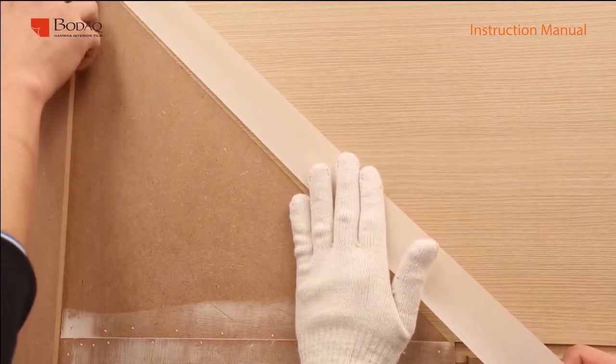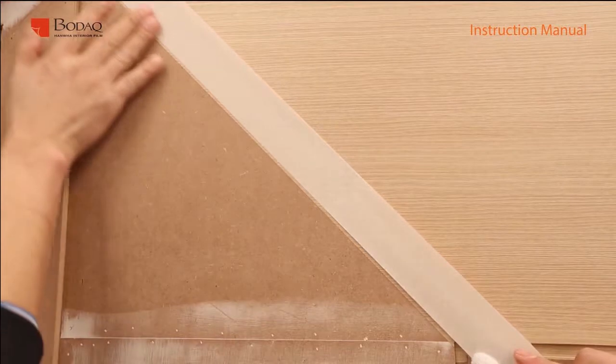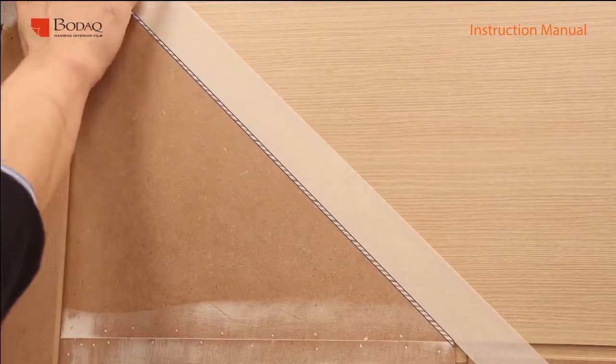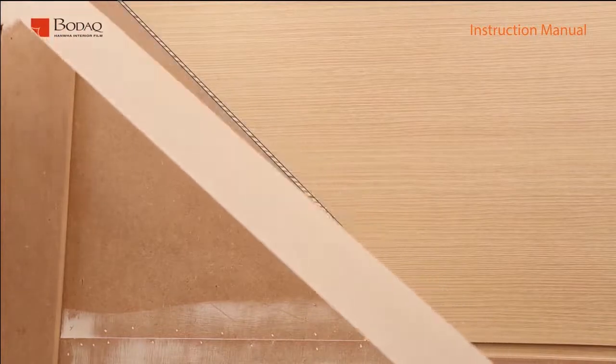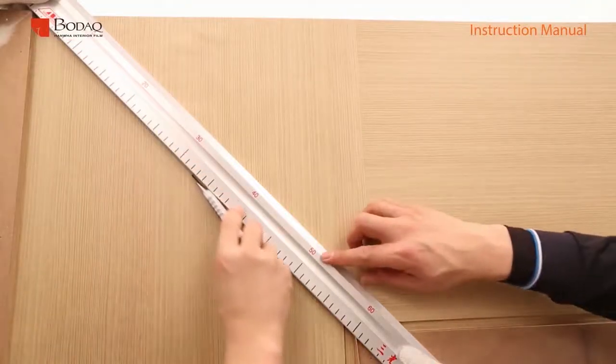In case of overlap and apply case, some parts of the film are overlapped so the joint part does not loosen. Except for the part that will be overlapped, attach masking film and apply primer on the part to be overlapped. After this work, take off the masking film, overlap the films and trim the remaining parts.